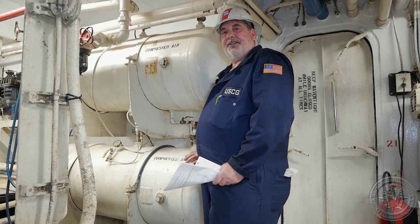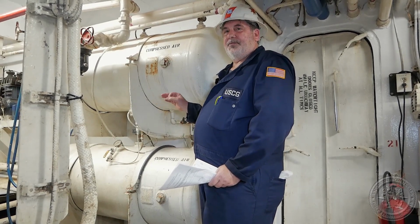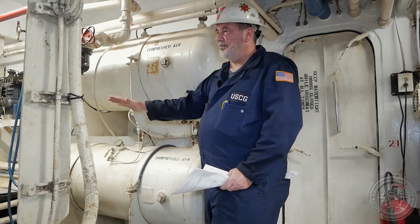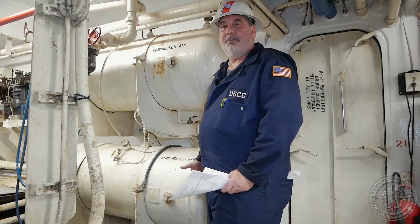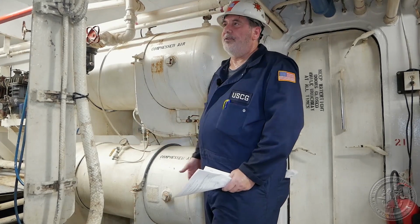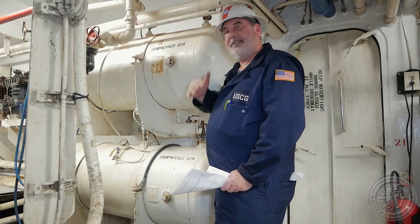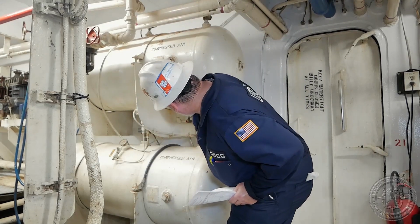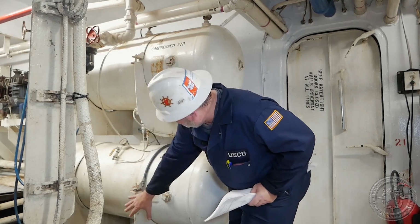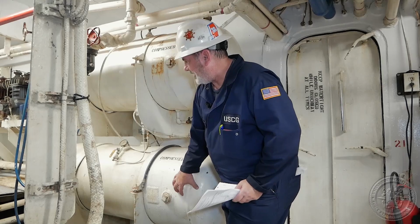Okay, to inspect a pressure vessel externally is really very generally to just put eyes on the whole external surface of it to look for corrosion and or dents or impact structures. So all you can do is verify that it's painted or unpainted, and generally look for rust.